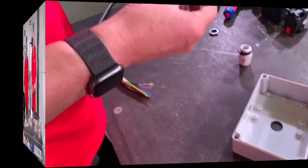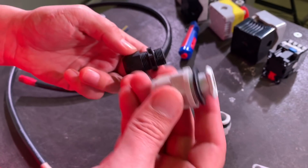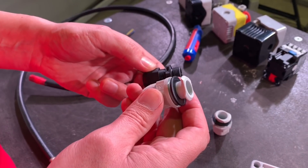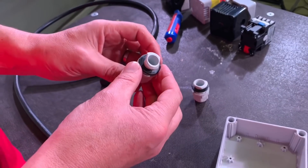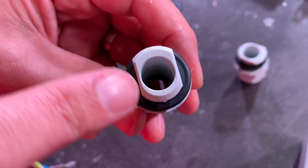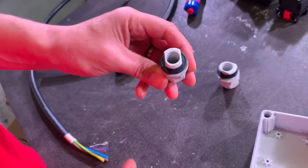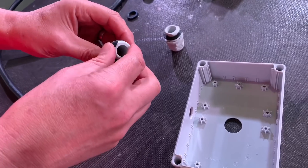Let's have a look at the gland itself. This is our Quick Fix gland, and the big difference between this and a normal gland is that on a normal gland you'd expect to see a threaded barrel where you put a lock ring. This one doesn't have a lock ring, which can help you out in a few situations. Let's have a look at how this mechanism works - you'll see the slightly longer side and a shorter side, and this chamfered edge where it would normally be a circle.